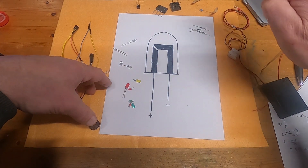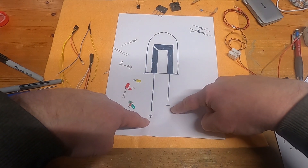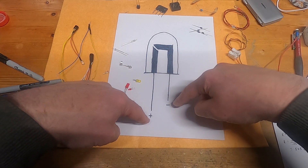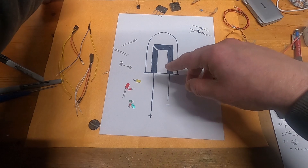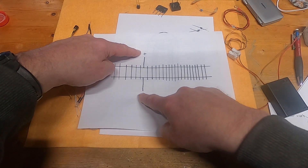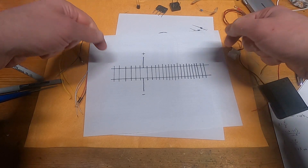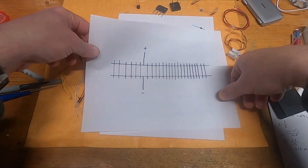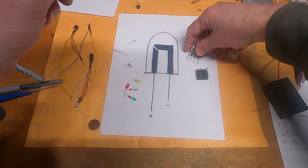All LEDs have a positive and a negative lead, which means if you wire them up backwards you're going to burn them up. You have to make sure they're wired correctly. The problem with DC trains is if you have positive on one side of the track and negative on the other, that's fine — but if you decide to run the train in reverse, the polarity flips and you're going to burn up your LED. One way to prevent that is with a bridge rectifier.